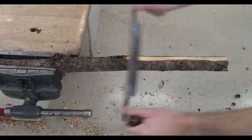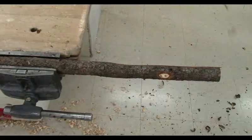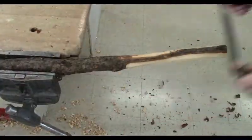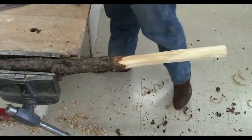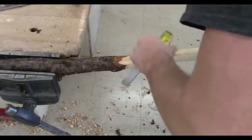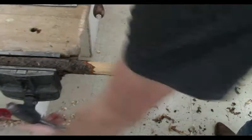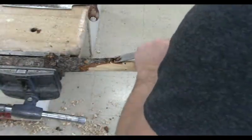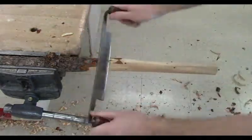This handle actually went really well with the draw knife — you can get a really good idea of how well it works. This draw knife is pretty sharp, so I'm being very careful when I pull it towards myself not to cut myself or pull it too close. I'm also making sure to rotate my mallet handle so I'm never pulling to the side or underneath — always pulling from the top where my best grip is and I have the most safety. Again, patience is very important — coming in, re-measuring, re-working it, making sure I do it right the first time. This is a good example of being patient with the chisel, coming in with multiple passes so I don't damage the chisel.